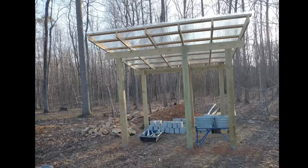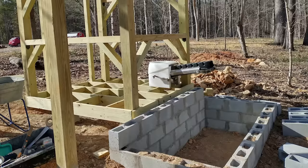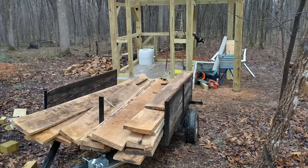Once the 6 posts were set, I added the 2x6 roof rafters, then the purlins and polycarbonate roofing panels. Then I returned to working on the decomposition chamber foundation, which ended up being 3 blocks wide, 6 blocks long, and 4 courses high. The next task was framing the floor with 2x8s and then adding the 4x4 inner timbers that would hold the board and batten siding. A plywood floor was next, followed by linoleum flooring and drip edge in preparation for the siding.